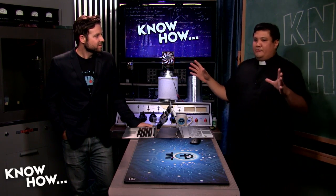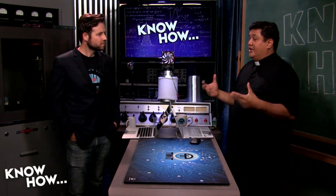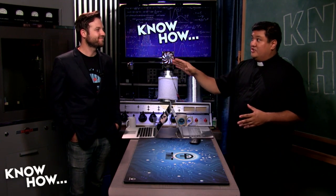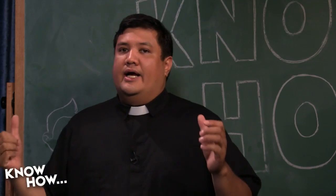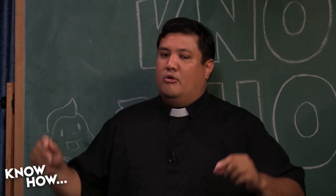Now let's go on to something that's a little bit more important for those people who are doing, say, indoor grows inside of apartments. This is odor control. This was the last reason why we said we wanted to care about ventilation, right? Right. In order for us to do odor control, we have to control where the air is coming from and where it's going to. Right, because if you're just circulating the air, it doesn't really help. In a closed container, it's not going to help.